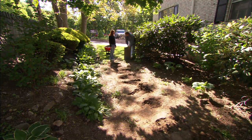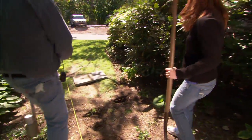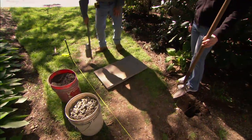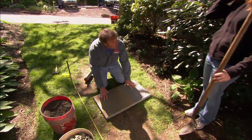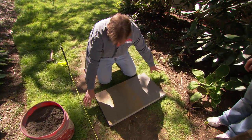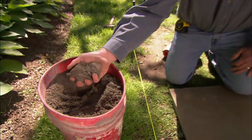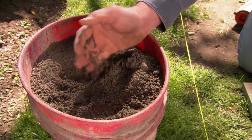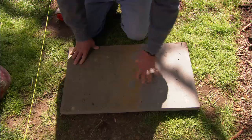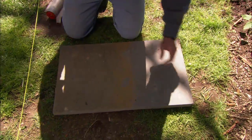It all starts with digging out the topsoil. This yellow string line I set represents the outside edge of the walk. We're going to end up having six inches, then the stone, and then six inches on the other side. Underneath the stone and on the sides, we're going to put in this three-quarter inch stone. And then underneath the bluestone itself, we're going to put this stone dust. It's really fine and it will fill all the voids underneath the bluestone so it doesn't rock. What we're going to have is six inches here, then the 30-inch stone, and then six inches on that side.